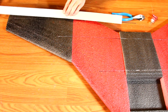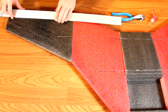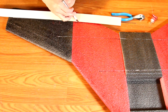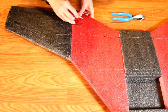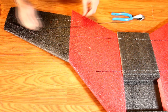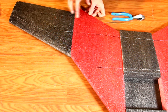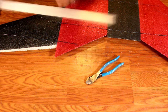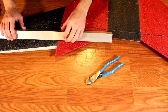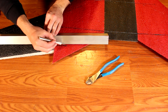If you want to make your airplane significantly stronger to crash damage, purchase two to three more spars and install them as shown. One spar should go from approximately the tip of the wing and extend two inches into the mid-wing — repeat this on the top and the bottom. In hard crashes this section of the airplane will tear, so doing this on the top and bottom will keep the airplane from tearing at this location when you smash into the ground hard. Note that the bottom spar goes approximately two to two and a half inches into the mid-wing section.